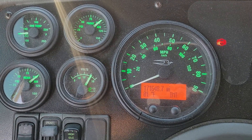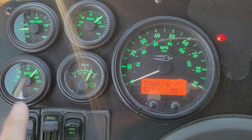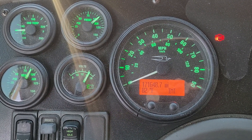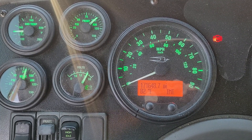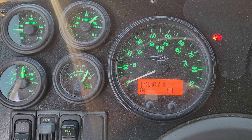Watch — rear tank going down. We'll do the same thing: when the rear tank drops down and the low air warning device comes on, release the parking brake, move the bus backwards, and stop with the service brake. That means the dual air system is working correctly.